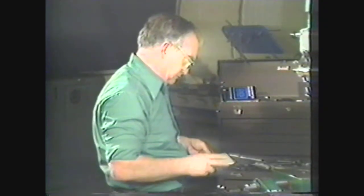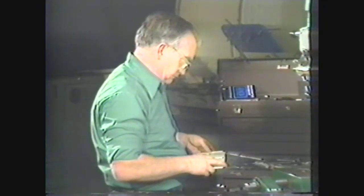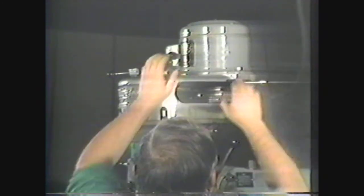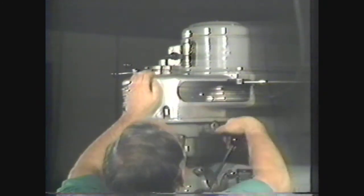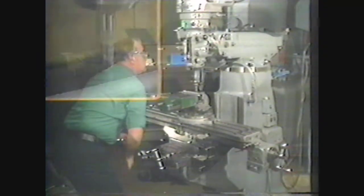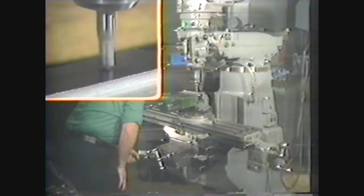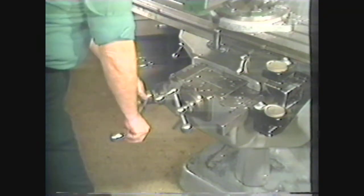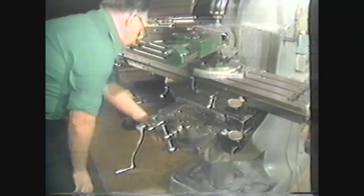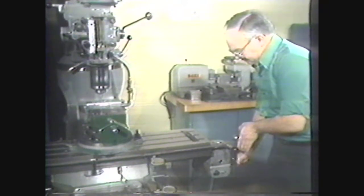Drop the knee and remove the edge finder. Place a one half inch end mill in the spindle collet and reset the spindle RPM. Use a 100 surface foot speed with a one half inch end mill — the RPM should now be approximately 800. Set the RPM to the closest setting on the milling head, which is 660 RPM. Using the spindle quill lever, bring the spindle down so the end mill almost touches the work. Lock the quill, then raise the workpiece to touch the end mill, zero the dial, raise the table one eighth inch using the dial as a reference. Lock the knee and using the hand feed, feed the end mill along the groove to a length of two inches, using the micrometer dial on the end of the table to determine the two-inch length.